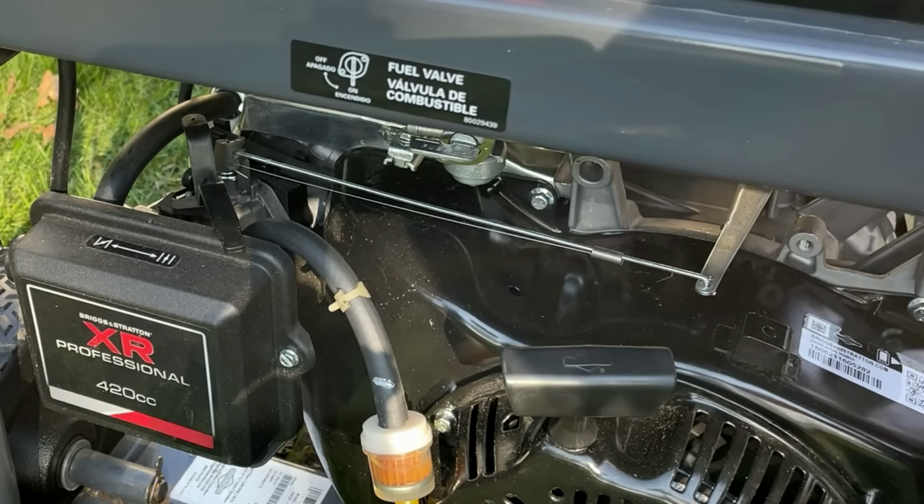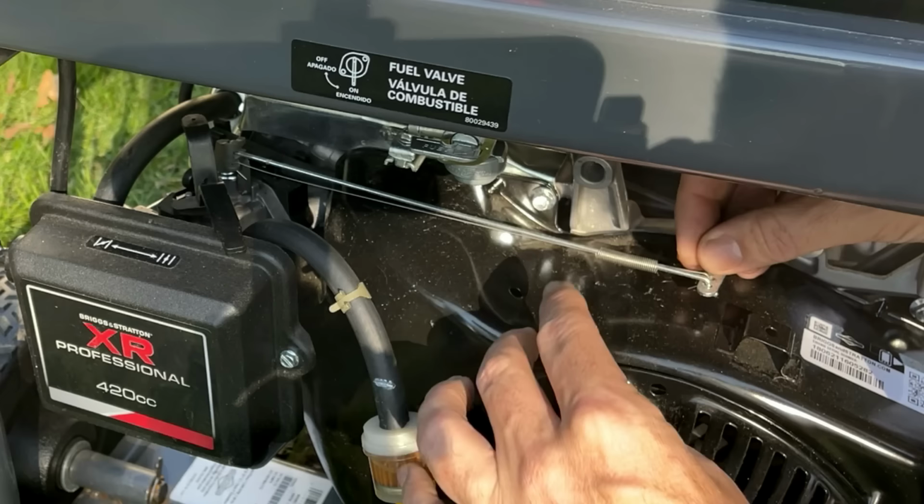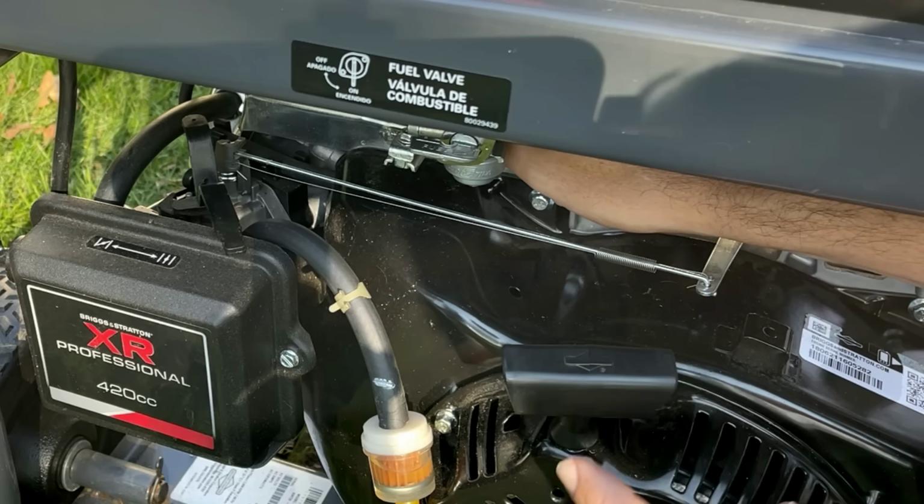Couple things. The engine is running a bit slow, and I noticed this spring was not connected, which seemed to be running fine without it connected, but it does help the engine so that it does not surge. So that's all set. I'm going to start it back up. We'll adjust the engine speed, bring it up to 61.5, and then try load testing it.